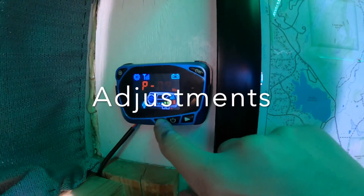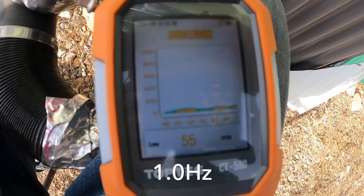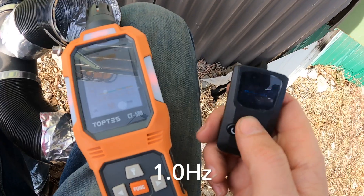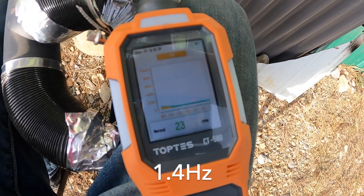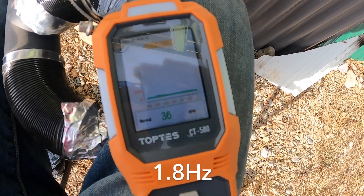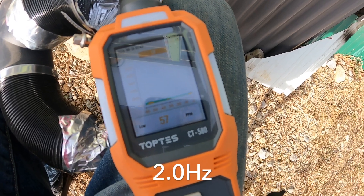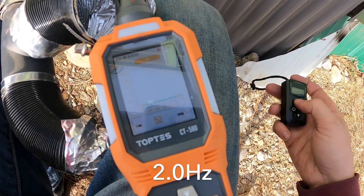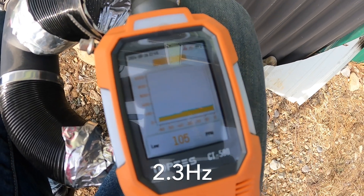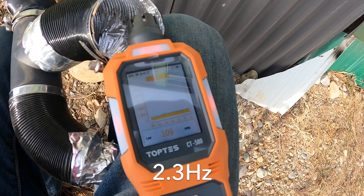Instead of running at that low, I want my low end to be around 1.0 hertz. Let's bump the high end up to maybe 2.3. Cranking it all the way down, it's basically oscillating between 45 and 55 ppm — that's okay. Going up to 1.4 hertz, it's running even better now, ranging from 15 to 25 ppm. At 1.8 hertz it's settled into 30 to 40 ppm. At 2.0 hertz it's oscillating between 40 and 60 — definitely worse than 1.8 but still not horrible. At 2.3 hertz, it looks like that equals about 100 ppm — over five times the particulates we had running at 1.4 hertz.